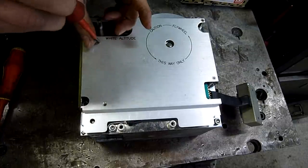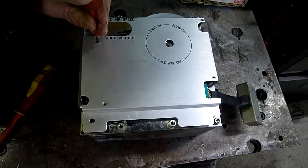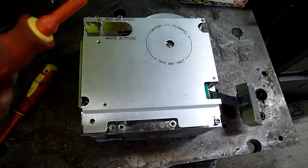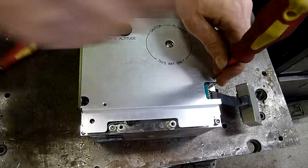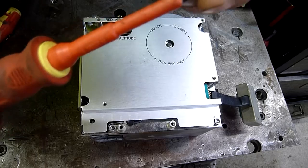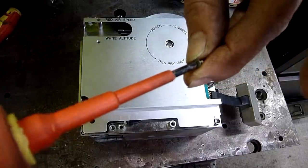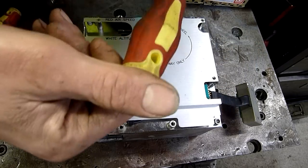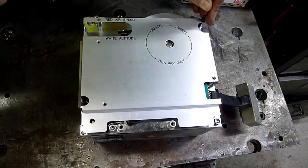Loctite - great stuff until you have to remove it like this. Especially red loctite - that looks like red. These screws are as good as new again. I don't know why they make them so sharply pointed - the point bottoms out before the driving edges are actually in the socket. These are Kayback branded ones. Kayback's a pretty decent company.